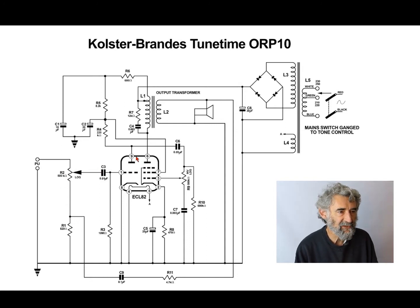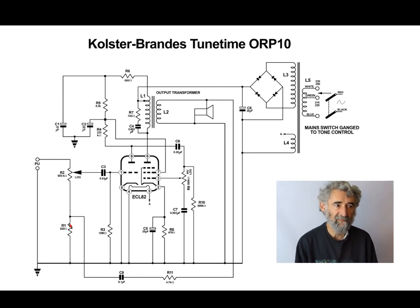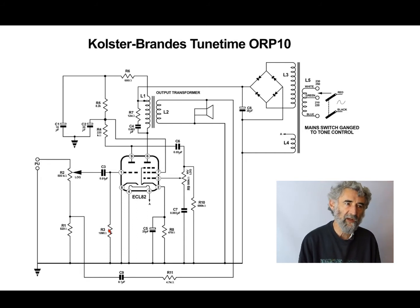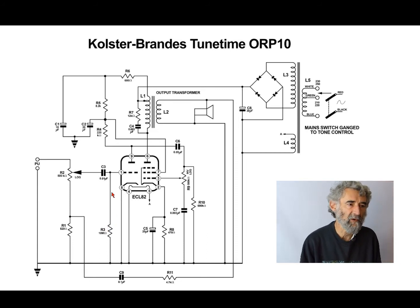The signal is fed into the triode. There's a blocking capacitor of 0.01 microfarads and 10 megaohms as a grid leak. There is no cathode bias component. A few electrons from the cathode on their way to the anode hit the grid, driving it negative with respect to ground — that is how the bias is achieved, which is why they need a very high impedance here. There are two disadvantages: the distortion is considerably higher with grid bias, and the gain of the stage will be a little bit lower.